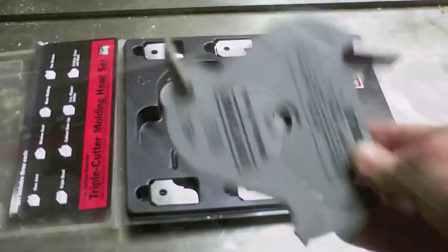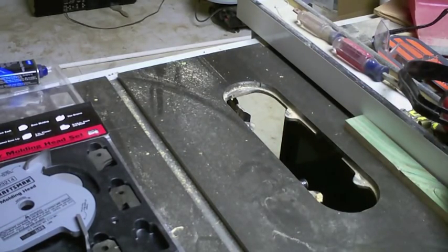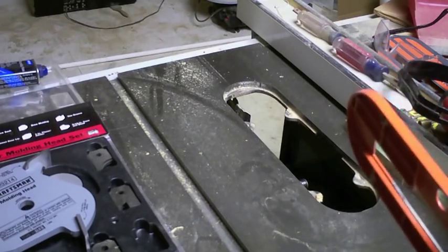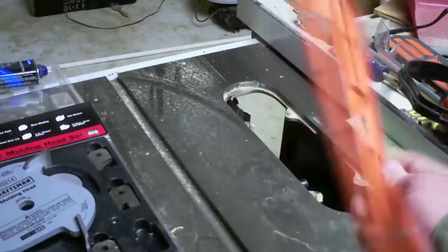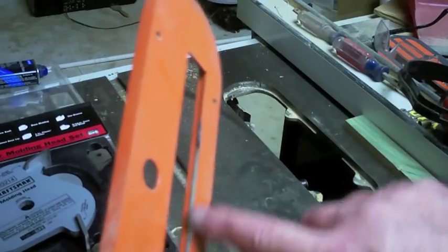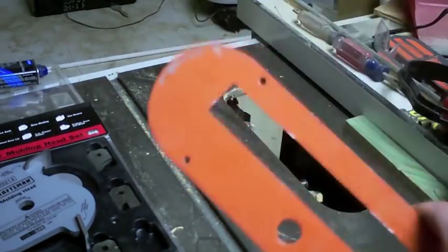Now I need to put it in the saw. You need to make sure that you have a big clearance insert — you cannot run it without an insert; that is an invitation to disaster. If you have to, you can always make one out of properly-thickness plywood, then raise your saw very carefully up through it. Put the edge of your rip fence on top to hold it down and very carefully, very slowly raise it up through it. This is the one that came with my saw; however, it wasn't wide enough, so I ended up raising my dado through the slot to widen it out. Since it's an aluminum plate, everything survived just fine — disposable ones are nice.